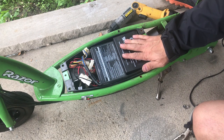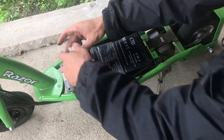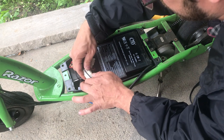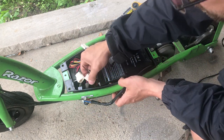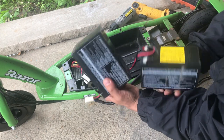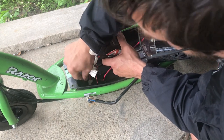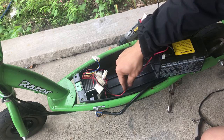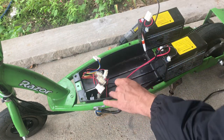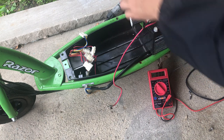The first thing I want to do is make sure they even have a charge at all. So we're gonna just unclip them. I think they're in series so we gotta be real careful about unclipping them and getting them out — there's almost no room, it's so tight. There's one, there's the other — it's attached to the charging switch. So now here's your two batteries. In the circuit together, I'm gonna stick the black in the black and the red in the red.